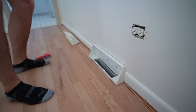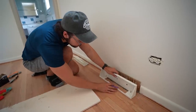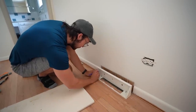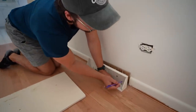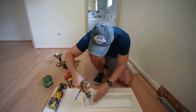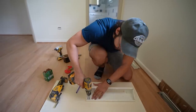We're making sure to drill the new holes where the studs are. Luckily, they marked where the studs are with some pencil lines. They're a little bit different for each vent, so we're marking them individually. I basically just line it up width-wise and use a pen to roughly mark where the stud is — it's an inch and a half wide so you have a little bit of wiggle room. We have a metal cutting drill bit, so I go about an inch down, line it up with the mark, and drill right through.